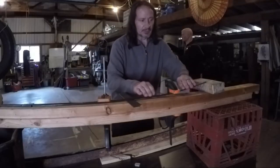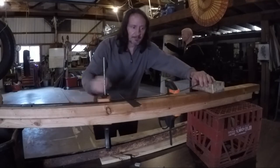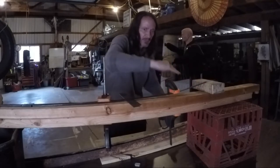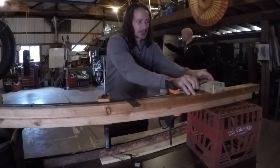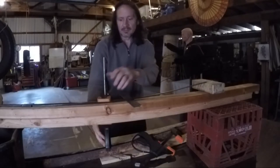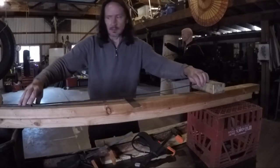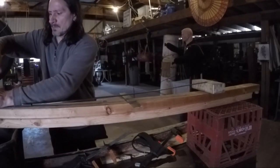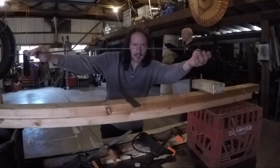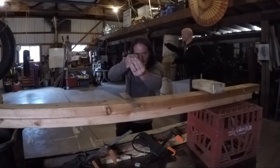I'm doing a little bit of blade straightening here. My blade had a bend to it after I did my heat treat, so I've got a clamp on it here and a bend that comes this direction, and I'm bending it up in this direction, clamping it down there. I'll release it right now, see where it's at. There. Look at it. It's still got a little bit of bend to it. See it right through there.